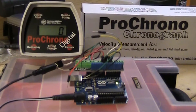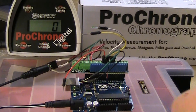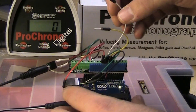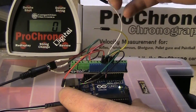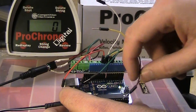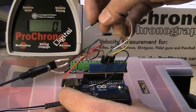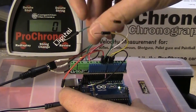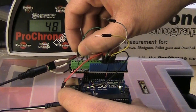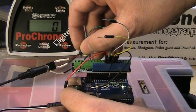Let me zoom in here on the Pro Chrono screen a little bit so you can see what's going on. The five wires sticking out of the top represent buttons. They would in real life be buttons, except that this is a prototype and I didn't have a chance to wire up buttons yet. So when I ground these wires out, it actually acts as a button press. So the first thing I'm going to do is use the string change button, so to speak. If I touch that to ground...